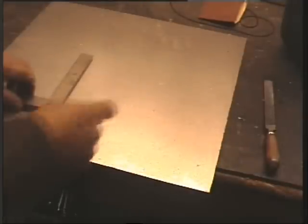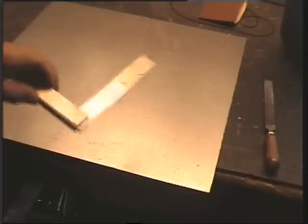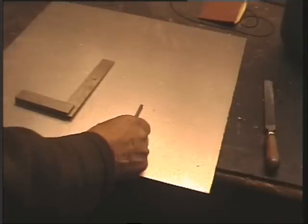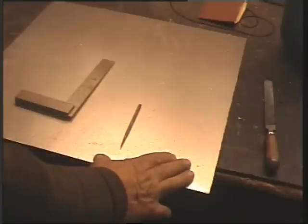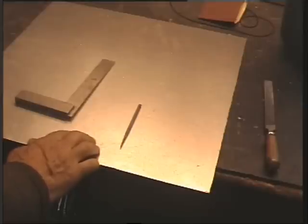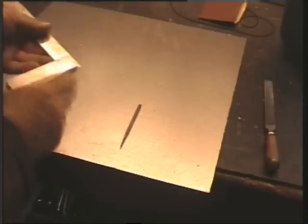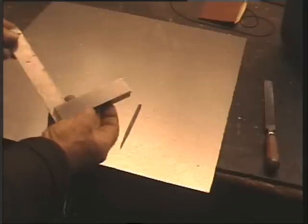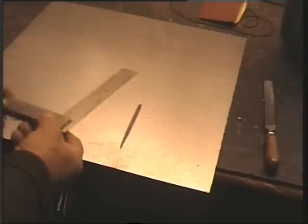In the beginning I was setting up my drill press table with the aid of a test piece, a torch and a square, to ensure that the table was at right angles to the axis of the drill. But how do we know the square's square? Take nothing for granted. There's no names on it. No one's proud enough to say I made it, so it could be Far Eastern rubbish. It isn't, but it could be.